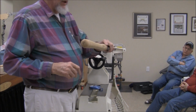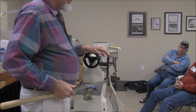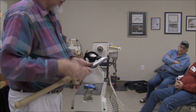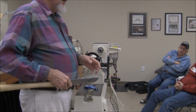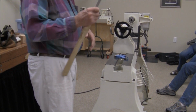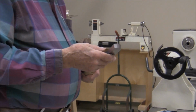1-inch pipe coupling, crepe myrtle handle, 1018 bar, and if I say reciprocating hacksaw, does that mean anything? Yeah. They're available. They go like this rather than round and round like a bandsaw. The blades are fairly heavy, and band type cutoff saws are a lot more common, but if you got a machine shop buddy that's got one, he'll have used blades. And you can buy them new and cut them up.